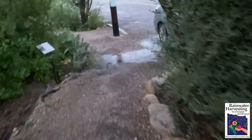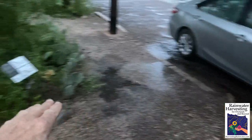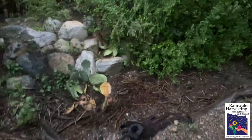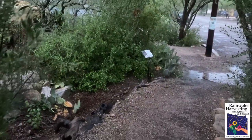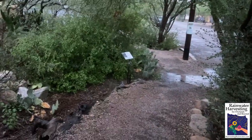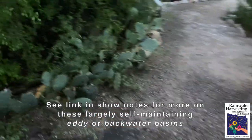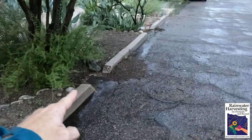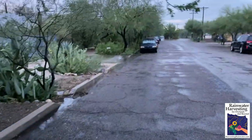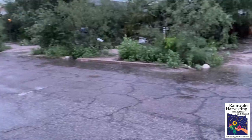This one's a shallower basin, so it's near full already. Then that's overflowed to here. Here we've got a dip in the curb because there was once a driveway here, so we've got water coming in. This basin could take a lot more water yet. The water back there that's overflowing out of those other basins will get here and help this one fill up. Once it fills up, because these are eddy or backwater basins — which I explain in my books and website — they're low maintenance, not flow-through systems. Once they fill up, the water backs up to the inlet point and continues down the street to the next water harvesting structure, and the next and the next. We've lined the whole block, so this street becomes the free irrigation source for the street side trees, which are still young and growing.